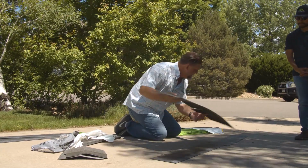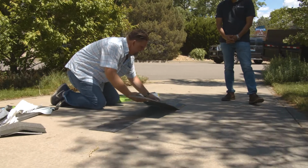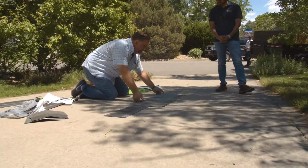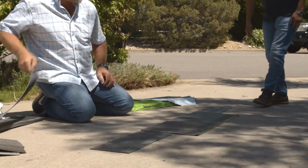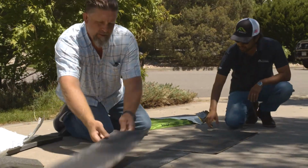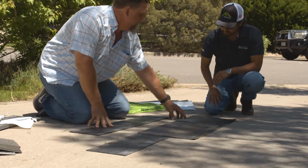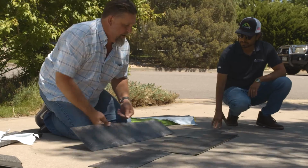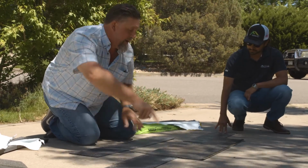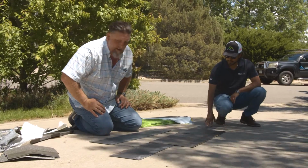Okay. You're going to line this shingle up, let's just say, with the one color that's going to go across. And you're going to keep moving the starter all the way across. You've got to find the right color here, right? Well, on the square cut here, it's not as important. You could do this black here, but it's not the same on the scallop shingle. Yeah, it's important, and I can show that in a second.